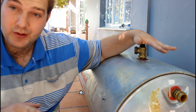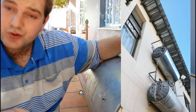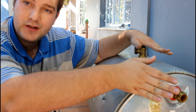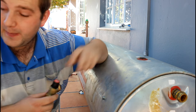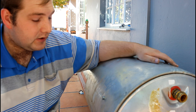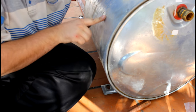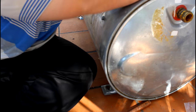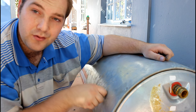I've seen - I'll put a picture up - where the person who installed the geyser did it the wrong way around, with hot water going in at the bottom and cold at the top. That's the wrong way and we're still figuring out how to solve that problem cost-effectively. This geyser has brackets with screws on all sides - if it's going against the wall you move the brackets to that side, same story for any orientation. They made these brackets for a reason, so you don't have to install it the wrong way around.